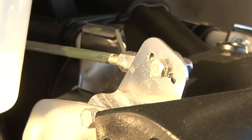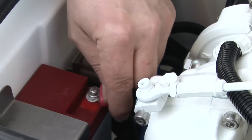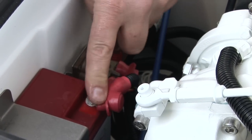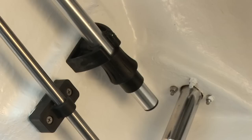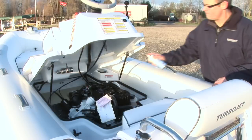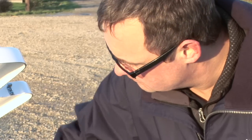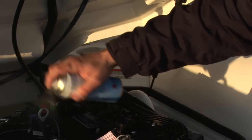Don't forget the cables at the back also need greasing. While you're there check the condition of the anodes. Use either a specialist dielectric grease or Vaseline on the battery and starter solenoid terminals. Whilst you have this, use a small amount on the bottom of the navigation light poles and their housings. It's a good idea from time to time to give the engine compartment a spray with a good quality corrosion guard, maybe once a month.